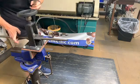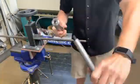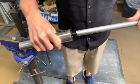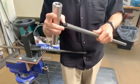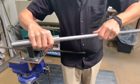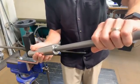Let me show you something about that. The inside of the mandrel's all stainless steel, and obviously it's threaded inside to accept the rod, but it has this relief. And there's a couple reasons for the relief. Our mandrels, by the way, we insert our threads in, and the threads are what always fail. So if the threads were to fail on this, we could put a new thread in, and this is a hardened thread rather than just an extension of this dent rod. So with the threads inside, the rod goes into the mandrel before it tightens down, and then it gets a nice fit inside there.